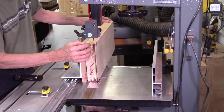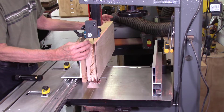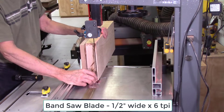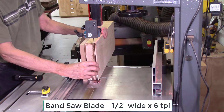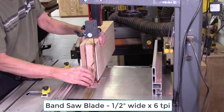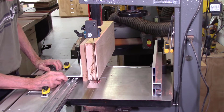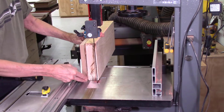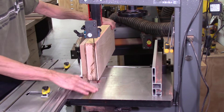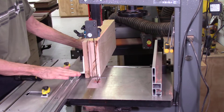I'm ready to start cutting this piece of maple board to make some guitar backs. This board is eight and a quarter inches tall by 22 inches long. I changed the blade — it's now a six teeth per inch, half inch wide blade. Previously for the guitar sides I used eight and ten teeth per inch blades, but because this wood is eight inches thick I went to the six teeth per inch. I also did one thing different in setting this up: I did not use a spacer underneath the sacrificial fence. The wood board goes right to the very bottom of the sacrificial fence, and I adjusted and attached it with clamps so it rests right on the table.